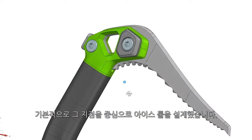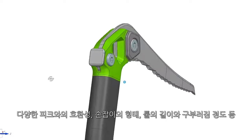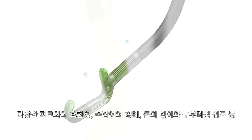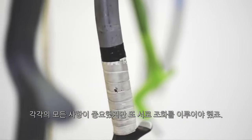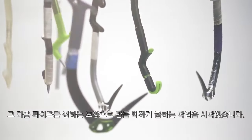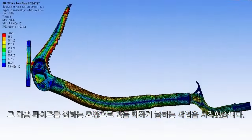That particular point is where I put the front bolt on the head and we basically designed the tool around that. There are all kinds of things to design around that: the different pick geometries, the grip shape, how long the tool is, how much bend there is, where your second position is, where your first position is — all of that matters and these play together. I just started going to town, bending pipes essentially, until I could get it to the shape I wanted.